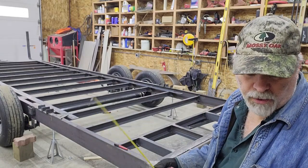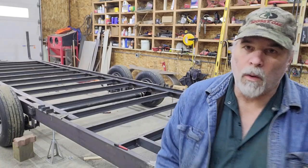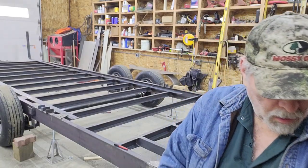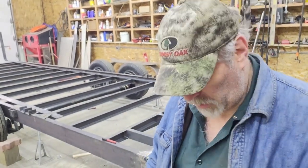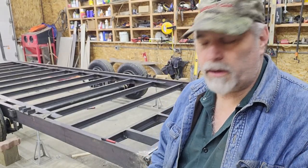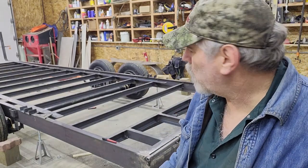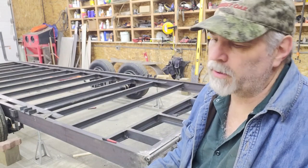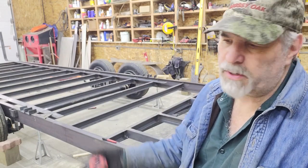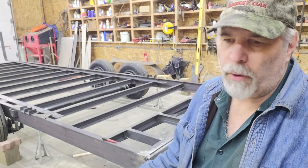While I'm at it, every once in a while I try to think of any tools that might be interesting to you guys. One, this tape measure. I'm sure you've all seen a tape measure. But this tape measure is a, I don't know what its official name is, I guess, a halving or self-centering tape measure. So if you're ever, whether you do metal work or wood work or whatever it is, and you need to know the halfway point on something that you're measuring, if it's an easy, nice, even measurement, say 24.5, that's really easy to know that the halfway would be 12.25.